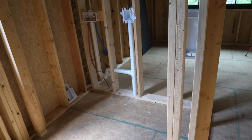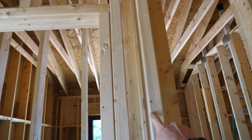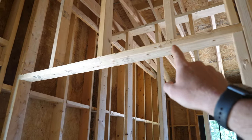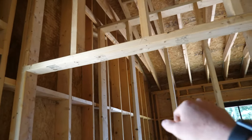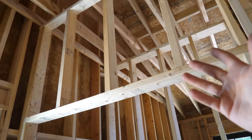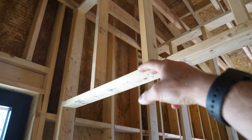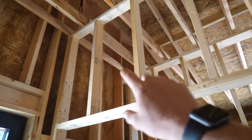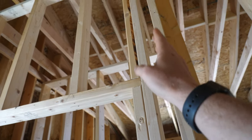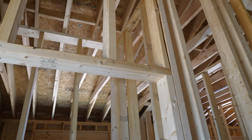That'll give us a little more room for opening the doors to the machines. Getting started on this laundry door, I'm going to try to salvage as much as possible, but I'm thinking I'll make this board here my new rough opening side. This is a non-load-bearing partition — literally just a two-by-four wall to hold drywall. I'm going to run some screws, toenailed because it's a little stronger in the grain. The screws will stiffen this all together from top and bottom, then I'll cut this out and sandwich more material between here to make one solid piece, with some long structural screws running all the way through.